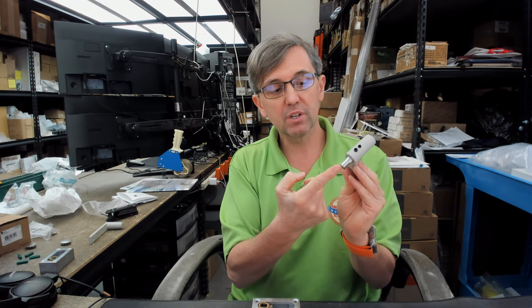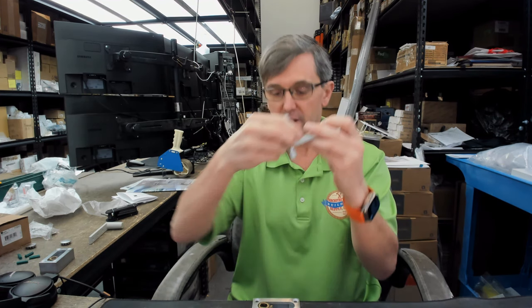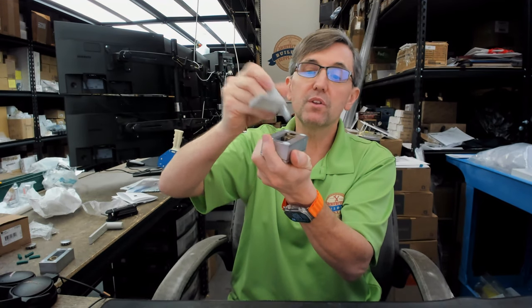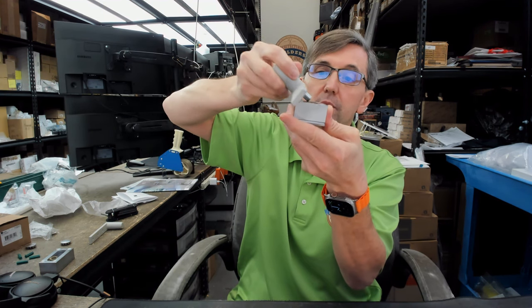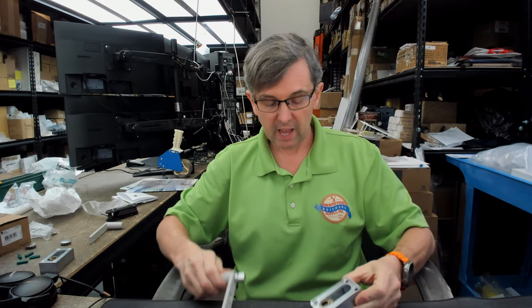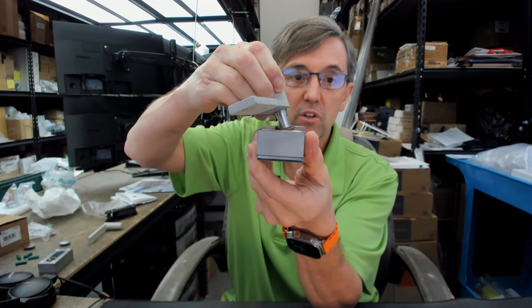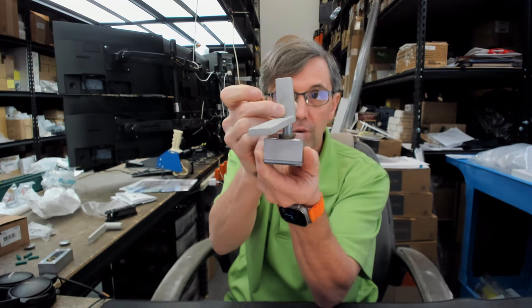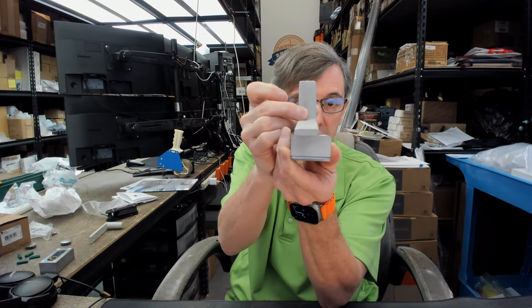The installation of this, and we're going to peek at the template and the installation instructions real quick, but just to go through a summary, that bottom pin is going to go in. You're going to hold it in place with a set screw. You want to hold it in place because you don't want it to rotate at all, because you want to be able to fit the pin into the female component of the pinion, so you can get it to fall in there, because you're going to have to bring the door to the opening and tip it in and then tip it forward. And I've become confident that you can approach it this way and get that lined up and continue to tip the door forward, and you can see that the bottom pin is not plumb, and it will fall in place and become plumb.